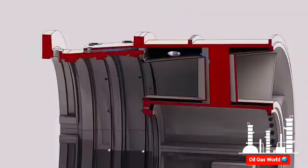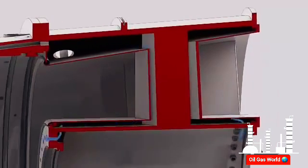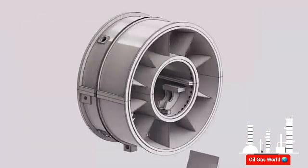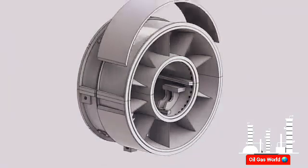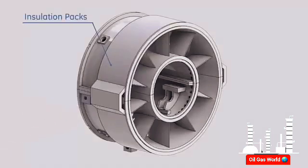A portion of this air goes to the cooling holes around the turbine shell, and the remaining air flows between the struts and their outer airfoil-shaped fairing surfaces. Cooling air then exits in two directions: to the third stage aft wheel space and to the inside of the inner cylinder around bearing number three, to protect the instrumentation in this area from high temperatures. The portion of the exhaust frame inside the exhaust plenum that is exposed to exhaust gases is covered by insulation packs to reduce heat transfer.